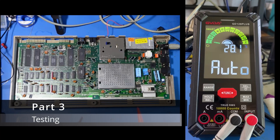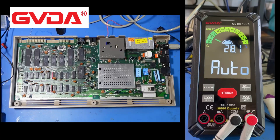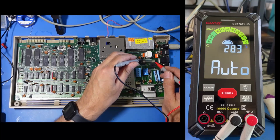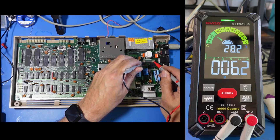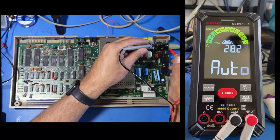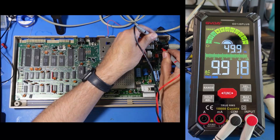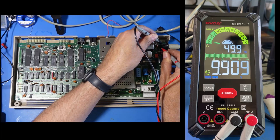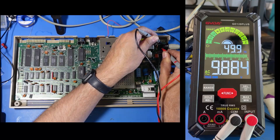We're going to do some real-world testing on this Commodore 64. I chose it because it's got AC voltage, DC voltage, and there's also a fuse we can test for continuity. Let's start with the fuse — and it's picked up the continuity check. You can see there's a green light at the top indicating it's good; I guess if it was broken the light would be red. Now let's try the AC which should be 9 volt — there you go, 9.9V AC. I haven't had to touch the meter at all; it's automatically switching for me, which is brilliant for diagnostics.